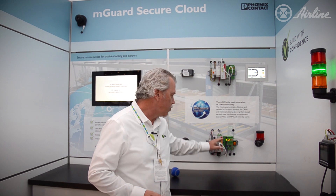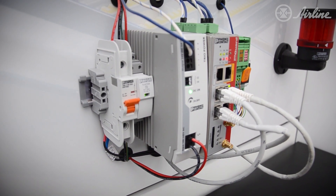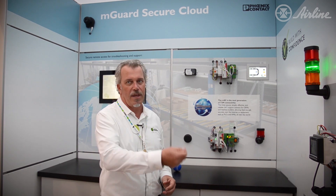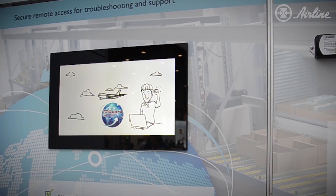The third aspect, which is really the most powerful part, is the VPN. We've got the ability to enable this via an external switch — as easy as a key switch — so you give the keys to the IT people in the shop. They can enable or disable the firewall based on the key switch, and then it tunnels out through the corporate network.